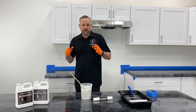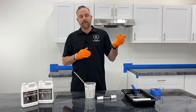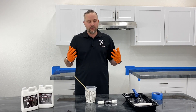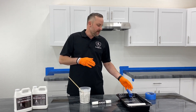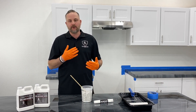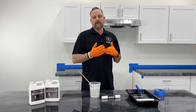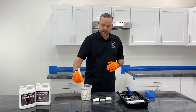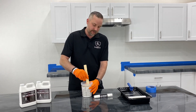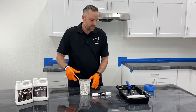Now if you've epoxied, you really want to apply the urethane within 24 hours of applying your epoxy coat. If you've waited past that, it's good to scuff up the surface with 220-grit sanding pads or higher. If you're sanding, be careful on your faces and edges — do those by hand. You don't want to use a palm sander on the edges; palm sanding the top is fine because it's thicker. Ideally, do your epoxy and then do the topcoat the next day — that's the best application for this process and will get you the best bond. But if you can't, just scuff the surface, clean it really well, and apply the urethane without any issues.